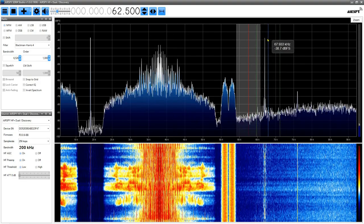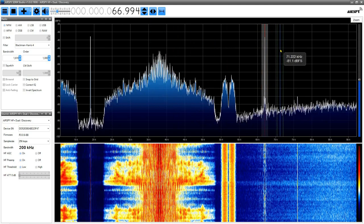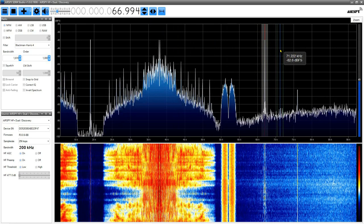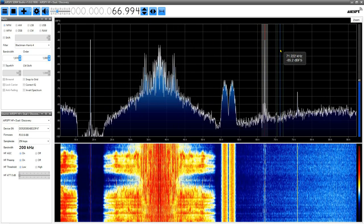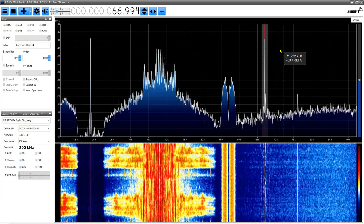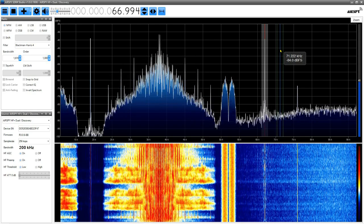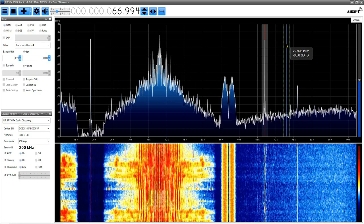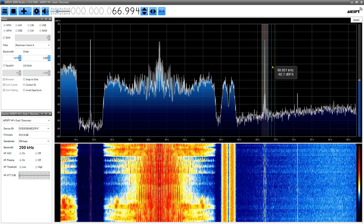Whoops, we moved. How can we keep moving? Yeah, it's just sitting there unmodulated. But FM broadcasters had the ability to do two stations like this, two signals, one at 67 and one at 92. This could be reading for the blind. This could be stock market reports, all sorts of different things. But due to the internet, a lot of that traffic is no longer available.